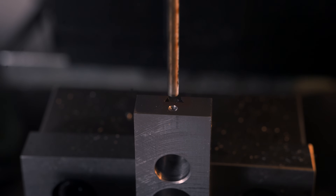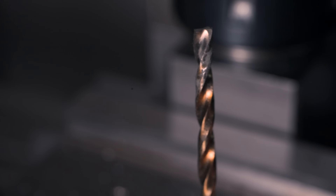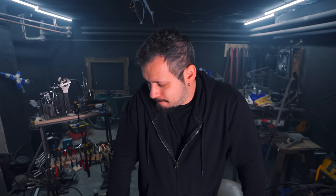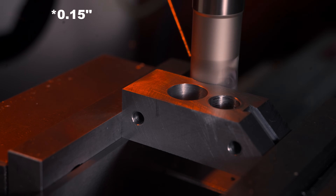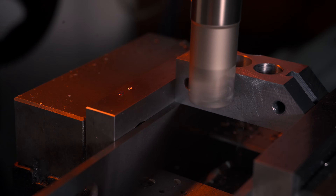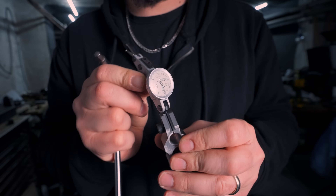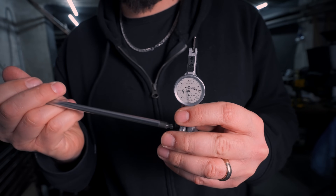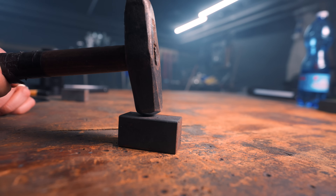Unfortunately, it would have been nice to keep some oxygen in the brain, because of what happened next. That little dance from the drill bit was it desperately trying to tell me something — that I had ground off its point 10 years ago. I even reamed the hole to 4mm thinking there was something left to ream. The result is that the 3.8mm drill bit dents itself a hole of 4.5mm. I went on cutting the rest of the relief for both flexures and slitting the front open, hoping I could still pinch the stem of the dial test indicator — and I actually could. But I knew I would have hated that fit for the rest of my life, so as painful as it was, there was only one right thing to do.